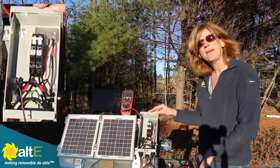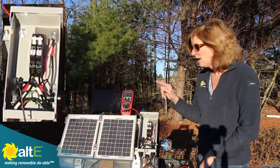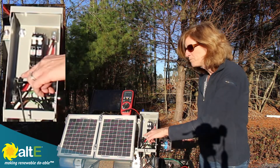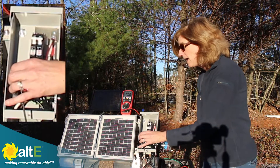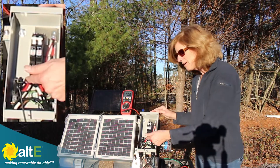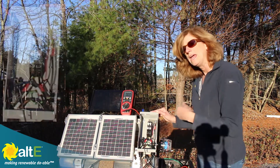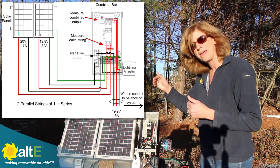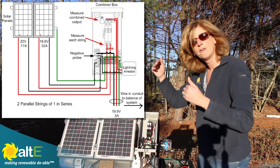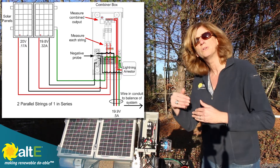I'm using an MN PV3 to combine my solar panels in parallel. I've got the negative from solar panel 1 and solar panel 2 going into my negative bus bar, along with the negative from my multimeter. The positive from each panel goes into its own breaker — if I had multiple panels in a series string, I'd have each string in their own breaker, so I could narrow the problem down to a specific string.